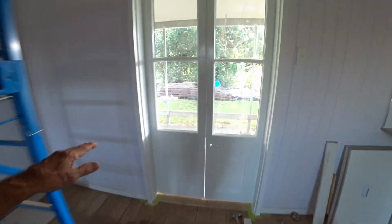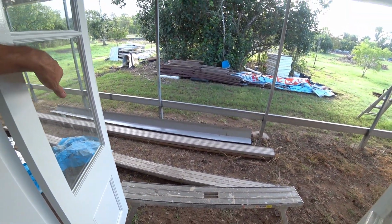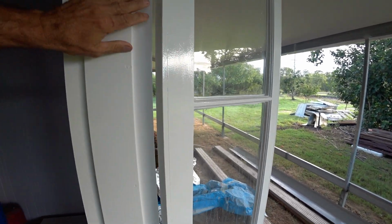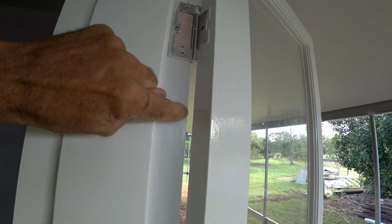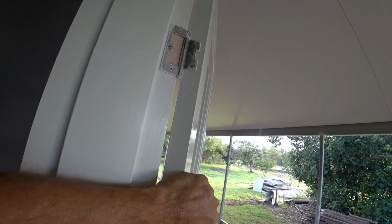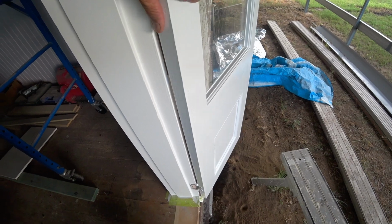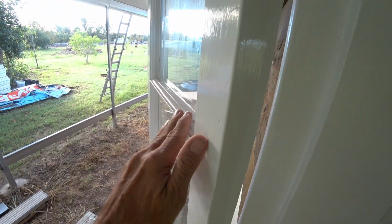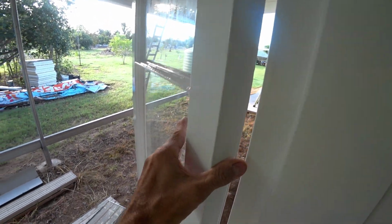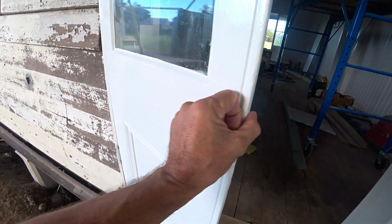And these are the other doors. Now the good thing about the oil-based gloss enamel is they don't stick. There's your water-based gloss enamel and there's your oil-based gloss enamel. Huge, huge difference. If you want the very, very best you can get, oil-based gloss enamel, use that same system I used, and you're going to have some beautiful doors that are going to last. I'm not kidding you. This will last. This is like a marine finish, you know, old oil-based gloss enamel. You see it so many times, 20, 30 years later, and still looks magnificent.